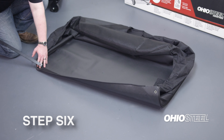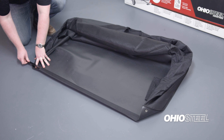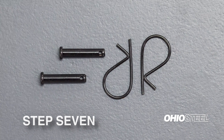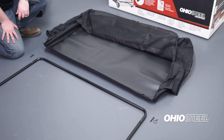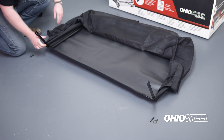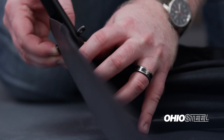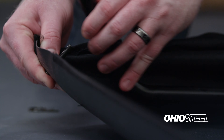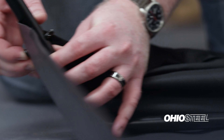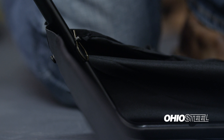Step 6: Locate the hopper bag and the hopper stop bar. Slide the hopper stop bar into the pocket of the hopper bag. Step 7: Grab the hardware blister pack and pop out both one-and-one-quarter inch long clevis pins and two of the seven hair pins. Insert the bottom frame tube assembly inside the bottom of the bag and push it to the back. Align both holes of the bottom frame tubes with the slots on the hopper stop bar and the grommets of the hopper bag. You may need to stretch the hopper bag with the frame assembly to align the holes. When aligned, insert a one-and-one-quarter inch long clevis pin from the bottom through the hopper stop bar and grommets. Secure the clevis with a hairpin, then repeat on the other side.